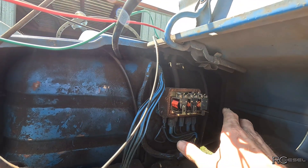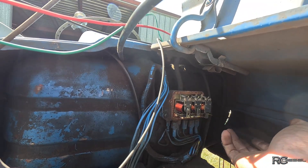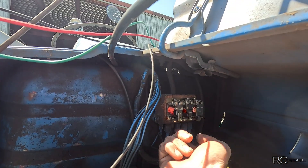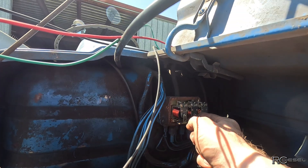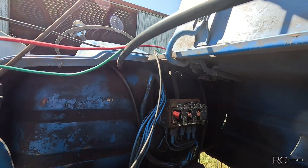So if I start the tractor and just push that contact on, it starts charging and everything works fine. I'm blaming it on the regulator — there are some resistors in behind there, and I think one of those resistors is burnt out and it's not allowing power to go to the secondary winding in that coil. So I ordered a new regulator, and I will return another day.